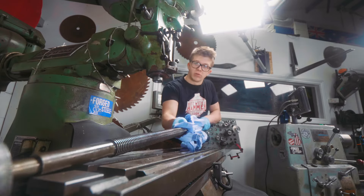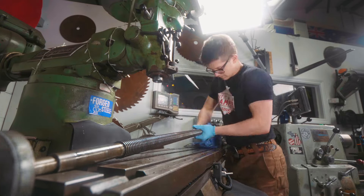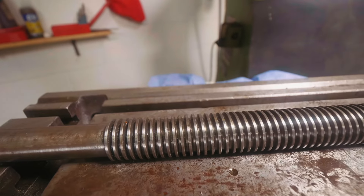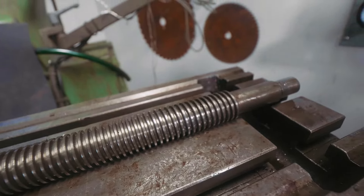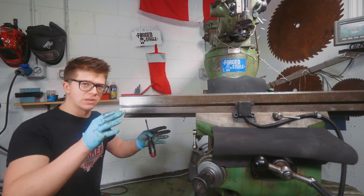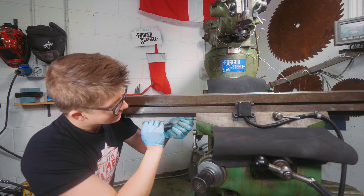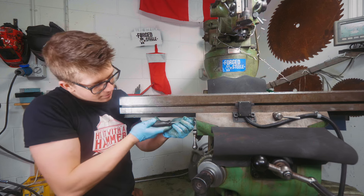I'm going to give it a really, really thorough clean. This actually doesn't look in too bad condition — it looks pretty good to me. I'm no expert and I have no idea what I'm doing, but I would say that screw is in really good condition. Over here it's obviously hardly been used, and it really doesn't look dissimilar to the middle where it's getting its most use on the nuts inside. You'll remember yesterday on the y-axis I took out that gib screw and shimmed it because there was a lot of play. The gib screw here seems pretty good.